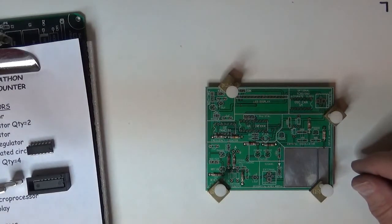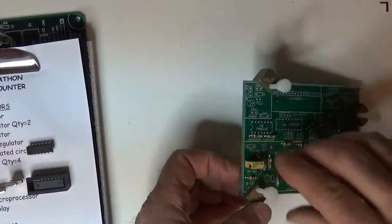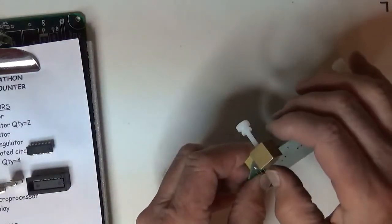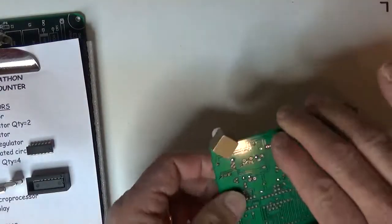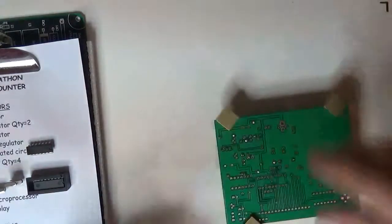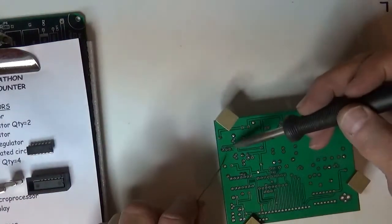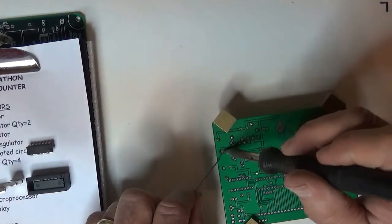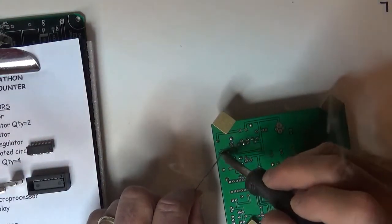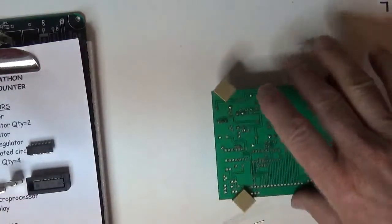I could probably go in there and do, here's the 500 ohm trim pot. I'll put the trimmer on the outside edge, lay that in there, and because I don't have to worry about the board being wobbly in soldering, I can just put the parts in any way I want. There's one, and I'll go for the second pot.